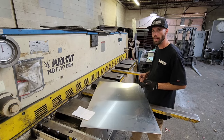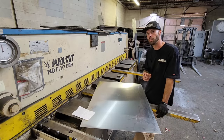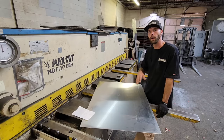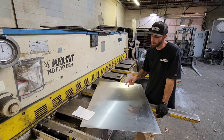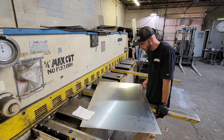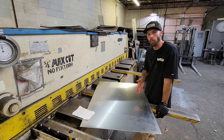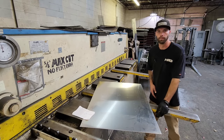The reason for that is because it's going to have only a 1.5 inch lip on the front of the flange. Now I'm gonna offset this so that I can put a 1 inch foam board completely around the entire live well and insulate it. I'm gonna move over to the brake. I'm gonna bend this thing up. I'm gonna put a slight bend right across here. And that's basically just a cross panel, that's what I call it. And that will help the water drain to the center hole here. Let's get this done. Let's get back to work.